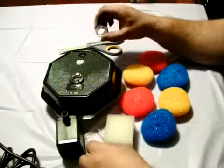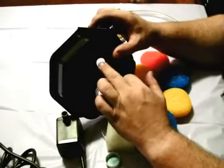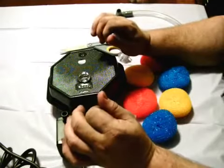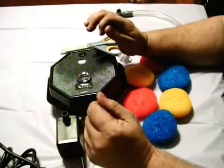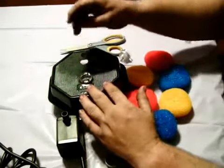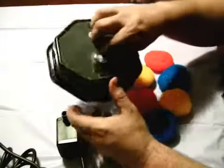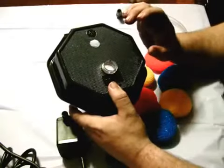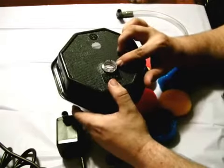Now to make these holes, and you'll notice I got them nice and circular, basically what I did was I got some old sockets of mine, and I have a heat gun, and I heated them up real good, and I pressed it down, and I had to work it and melted the holes through. Now this lip right here is basically what I sized my socket to, that way I could screw these threads in.